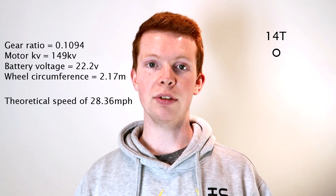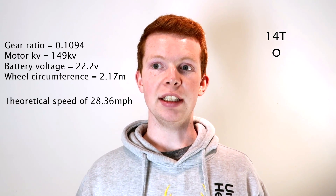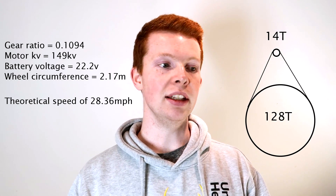If you've seen my other videos, you'll know I love 3D printing parts — and what you probably won't know is that I'm not very good with metalwork, i.e. I can't weld. The plan for this bike is to use just 3D printed components apart from the belt and electronics. Since the smallest motor pulley I could find was a 14-tooth, 22mm diameter pulley, to get the correct gear ratio for the KV and batteries I'm using, I'd need a 211mm diameter wheel pulley — which I obviously couldn't find anywhere, making 3D printing it perfect.